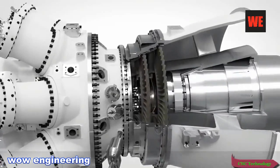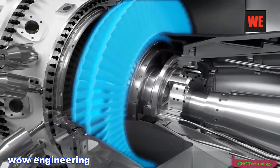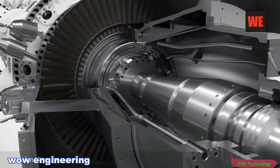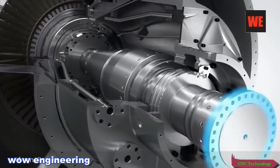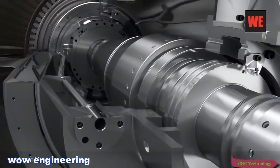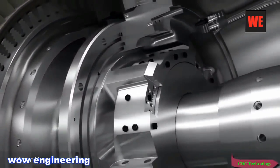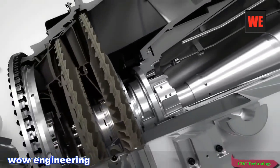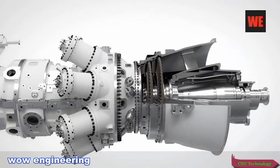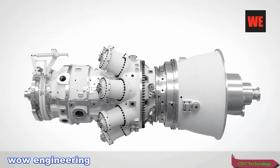The Free Power Turbine is a two-stage high-speed module nominally running at 6,100 RPM. It's equally suitable for mechanical drive application or, with speed reduction gear, power generation. The Free Power Turbine makes the unit an excellent choice where grid requirements call for maintained power output in the event of frequency drops. It can be optimized for all ambient conditions — arctic, temperate, and tropical climates.